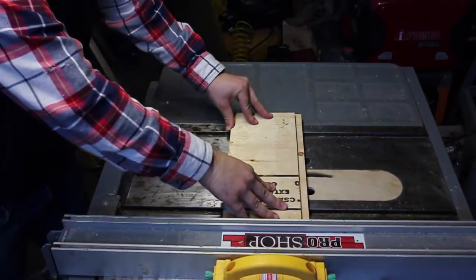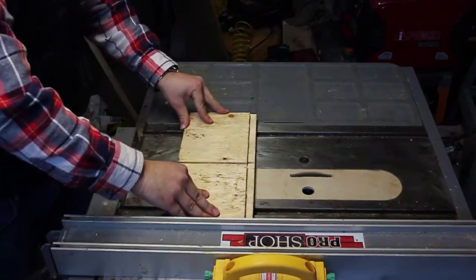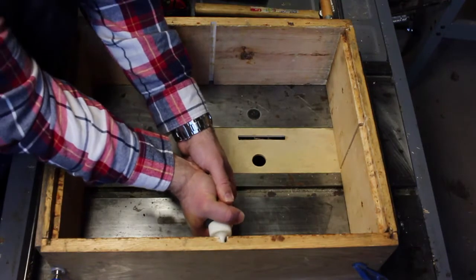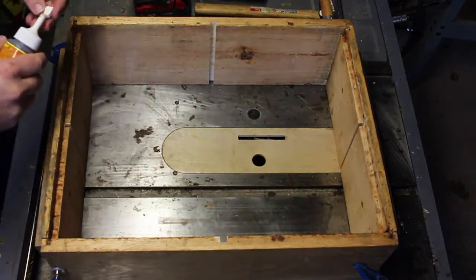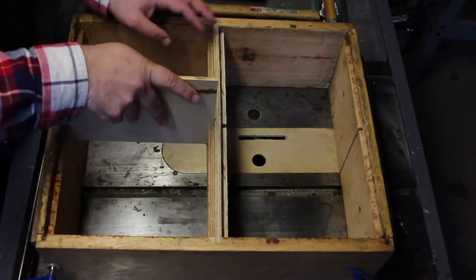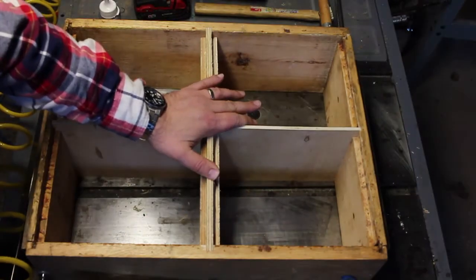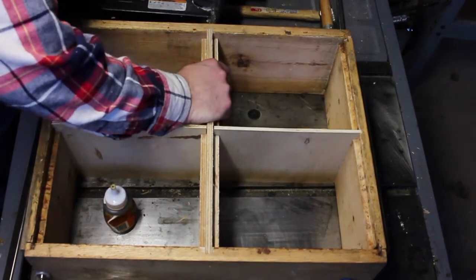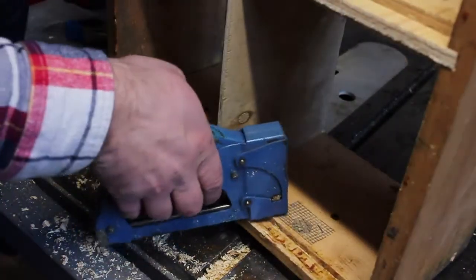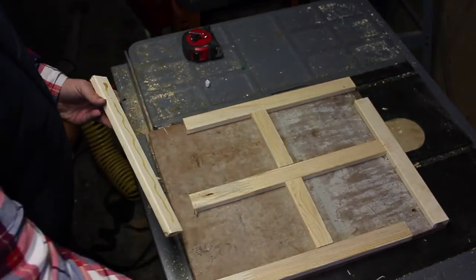What I am doing here is making the corresponding eight-inch dado cut. Now it's just time to glue and staple everything together for you to see what the finished product will look like, and here I am just adding some ventilation holes covered with hardware cloth. Now it's time to make the bottom board. The important thing with the bottom board is to make sure that each entrance faces its own direction.